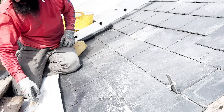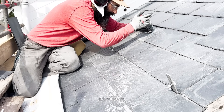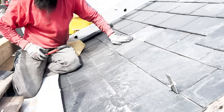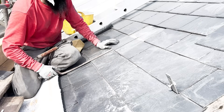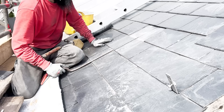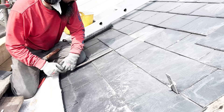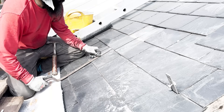Pushing under my bum made it a lot easier, I have to say. This is the beginning of a bit of abortive work — I took this nail out because I wasn't quite thinking about what I was doing, and it ultimately just has to go back in later. The one I wanted to get out was this one, but I can't get a grip on it. So I put the rip in underneath to pop the nail head up a little bit. You can see how hard it is to push in for this one because that nail is down fast. The other ones aren't always hammered in tight. I got this roof done about eight years ago and because it hadn't been touched since then everything was quite uniform.